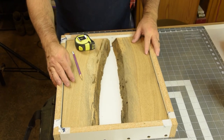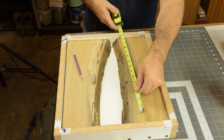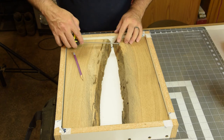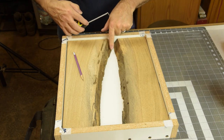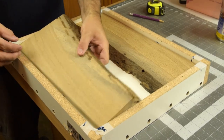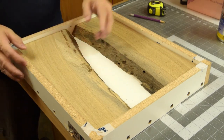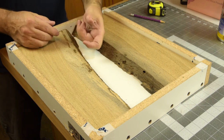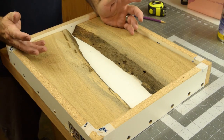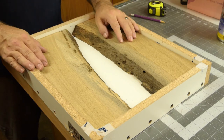There's a quick and easy way to determine what volume — how many ounces you need of the epoxy to fill this void. The first thing you do is just make a mark every two inches along one of your panels, and then get an average width measurement. Instead of taking it at the top or at the bottom, just assume you're taking the measurement halfway down the thickness of the slab, and you'll be very close to your actual number. On our oak epoxy board example, we've got one inch thick material. The volume calculation is average of three inches wide, by one inch deep, by 16 inches long. When we plug that into the volume calculator, we're getting between 26 and 27 ounces as the required volume. So if you mix up about 30 ounces and you have a couple left over, you'll be in good shape.